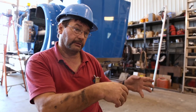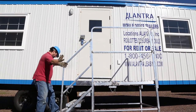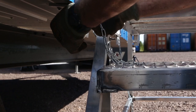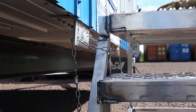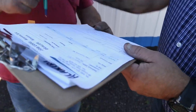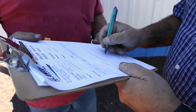Now I get my steps out of the truck, go by the door with the steps, sit them down, and put a piece of plywood under each leg — six legs — and level them off, making sure the steps are secure and don't move. After that I put my safety chain on them, the chain that goes on the trailer, to make sure the steps don't move away. Then I give the customer the paperwork: I get a copy for myself, give a copy to the customer, he signs and I sign — so that way we have confirmation we delivered and set up everything, and I'm all done.